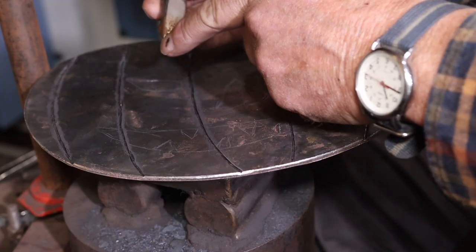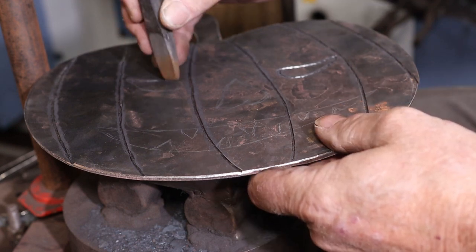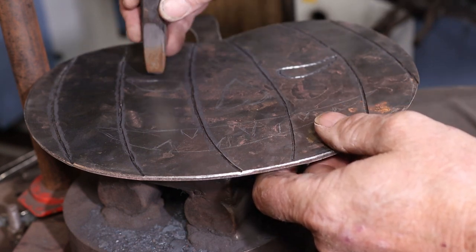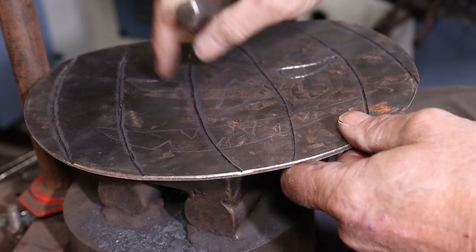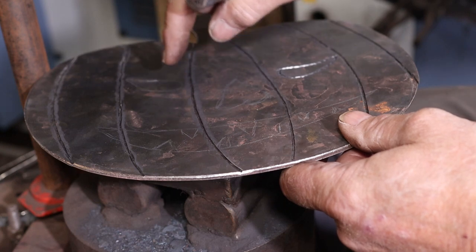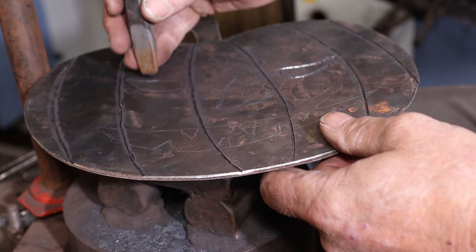Again, this chisel is a little bit curved on the end, so I can go around some corners, but I have to be real careful through here. This is kind of a tight corner. Curved chisel might be better for that. Another option would be to actually drill out this section with an appropriate size drill bit, and then it's just done. And we may still do that.